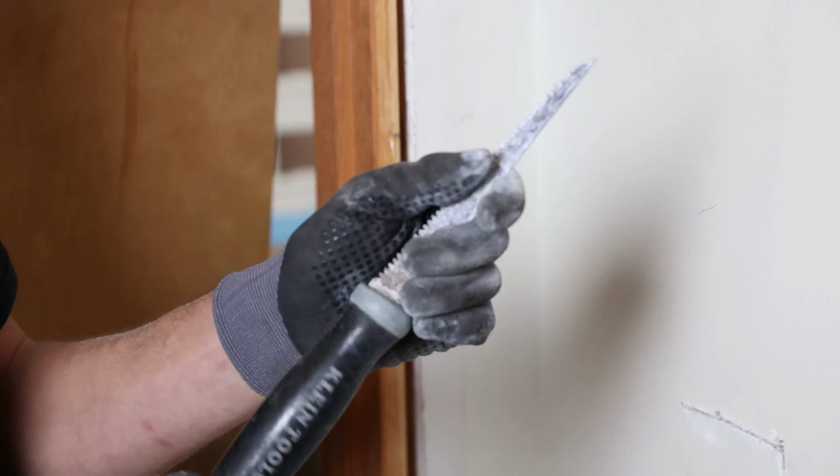Now here's a quick code thing. The outlets in this bathroom need to be a dedicated 20 amp circuit with nothing else, just the outlets. But there are a couple exceptions there. One, you can share the outlets of this bathroom with the outlets of another bathroom. Two, you can share the outlets of this bathroom with the lights of this bathroom. But you can do one, not both. Take your pick. In this case, we had three circuits coming into the bathroom. One is 20 amp dedicated to outlets. Boom, spot on. Second is 20 amp dedicated to lights. Overkill, but no problem there. And the third is actually going into the master closet because we wanted to put it on by itself to avoid having a technical code violation with one master closet receptacle tied into the bathroom receptacles. So we've got the bases covered.